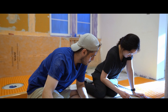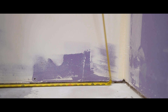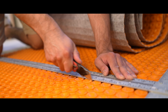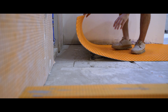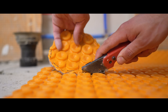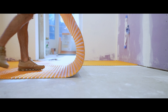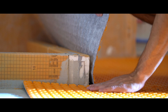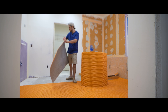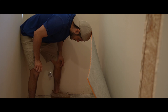Luckily I have Michelle for this one. Let's start cutting. Even though this is DITRA specifically for heated floors, it cuts and installs the same as any regular DITRA. The only slight challenge is cutting holes for the drains. When cutting the size I'm going to leave minimal gaps between the wall and the curb. I'm also trying to line up the lugs of the mats as best as I can so the wire can run straight through with no kinks.